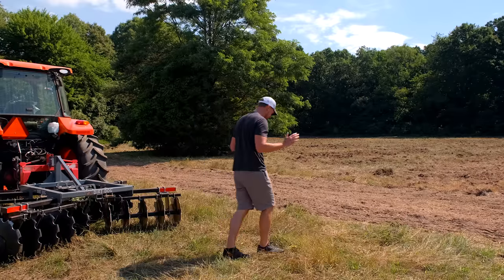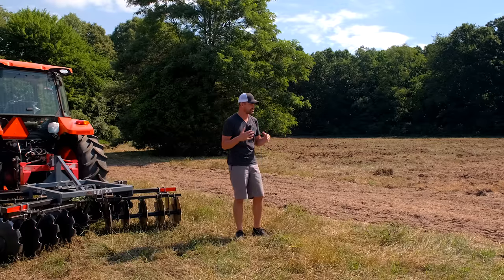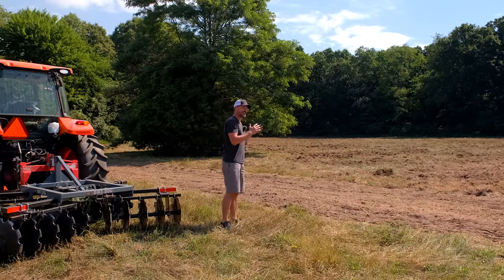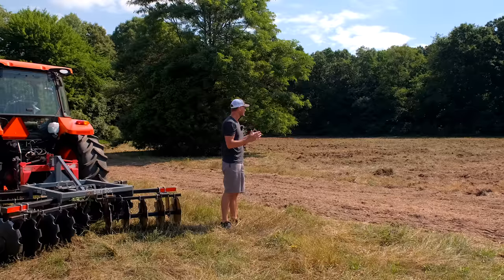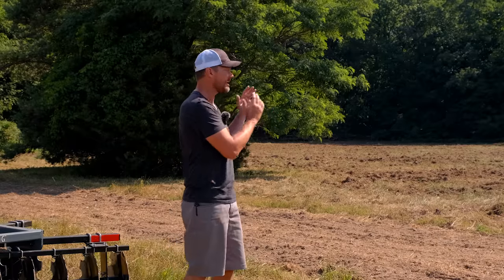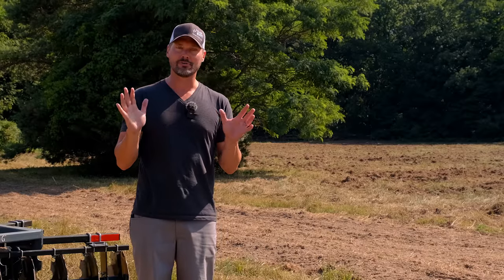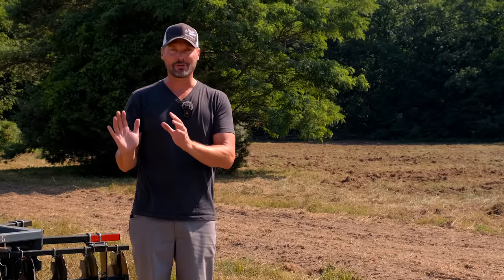with the 3025E, which is supposed to be, well, it's the same nominal 25 horsepower engine, but displacement's different, torque's different. It should have handled it a heck of a lot easier. It's a heavier tractor too. It should have more power to the ground, but that thing, it stalled out again on me. And I was able to get it back and through the job, but I had to kind of watch my speed. It was a constant change on the hydro pedals on how hard I was pressing it. It was not just holding it down like I was with the 1025R. And so lo and behold, surprising results. I did not expect the 1025R to outwork the 3025E, but that's exactly what happened.